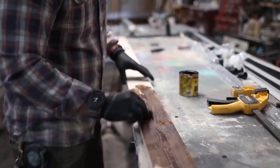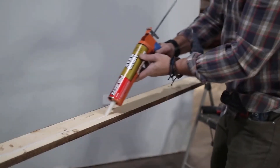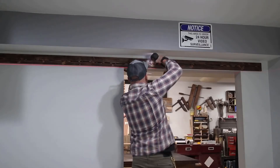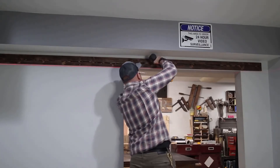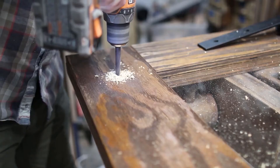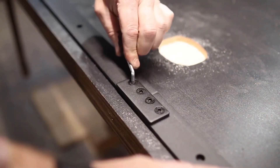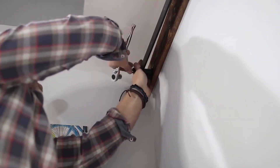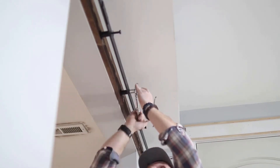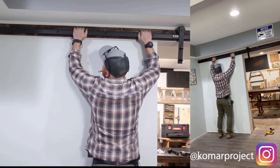The door is about 150 pounds, which for a barn door this size is nothing. I installed a pine header — since I'm putting in acoustic panels, I needed to bring the door off the wall a bit, and the header gives me the clearance I need. Next I installed the track kit to the door and wall. I needed a rail around nine feet long; the closest option was a 10-foot kit on Amazon for $65. I'll leave a link to it and everything else I used in the description below.